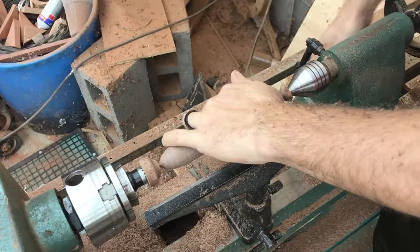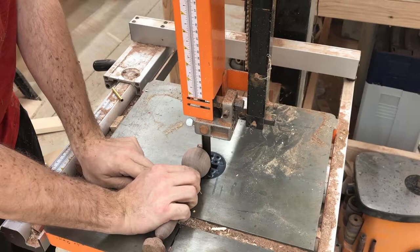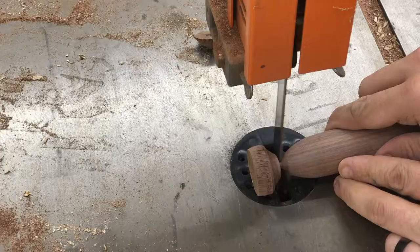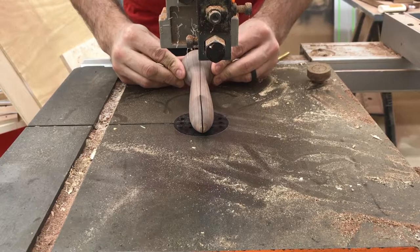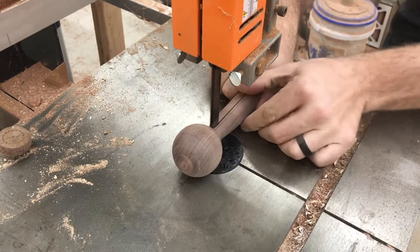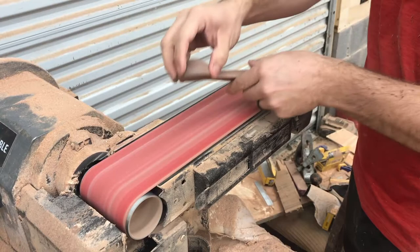I use the detailer to get the material on the ends as small as possible, then take it to the bandsaw and chop that off. Then I cut the piece in half so I get two spoons. Do this at your own risk because it is round and can be tricky — use clamps or be very careful. The way I'm doing it is probably not the recommended way, so use your own judgment and be safe.